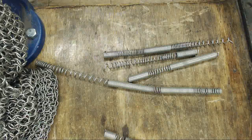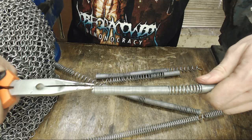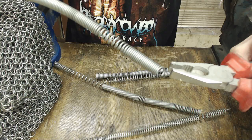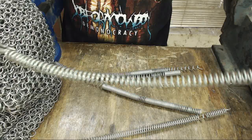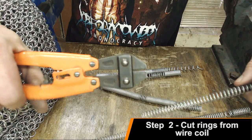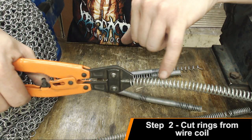Okay, so what you wind up with is something like this. You take your pliers, grab one end, grab the other end with the other pliers, and you just pull it apart. With mild steel like this it's quite easy to do — might not look like it but it's really not that difficult. You end up with springs like this. What you want to do now is take your mini bolt cutter and cut in a straight line — each cut just follows on the next one. You're going to cut your rings out.